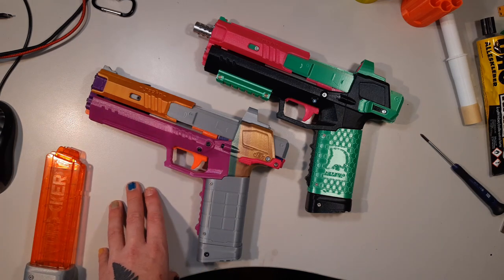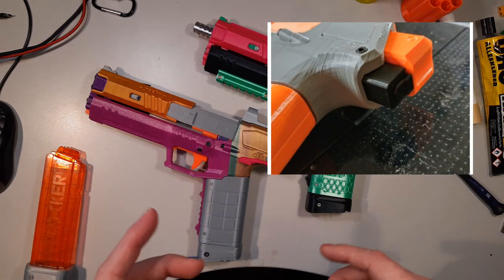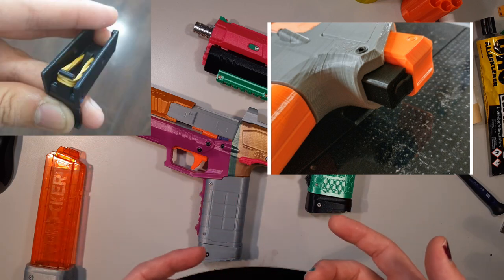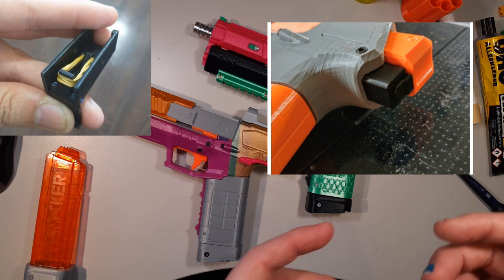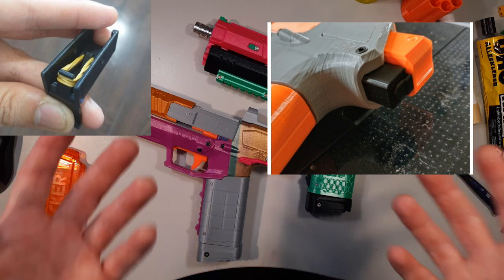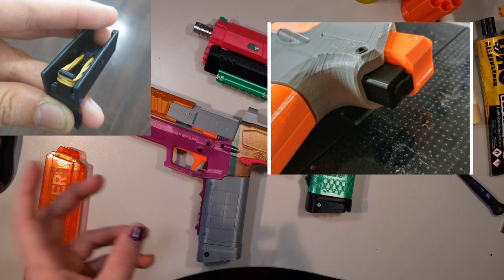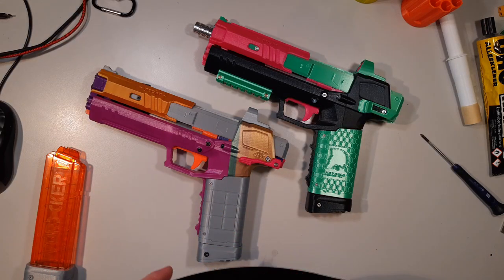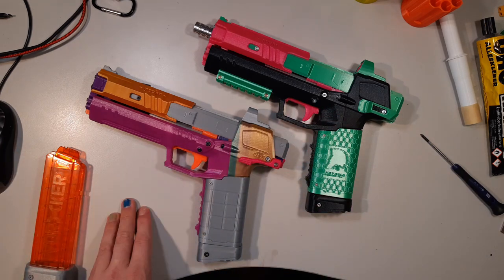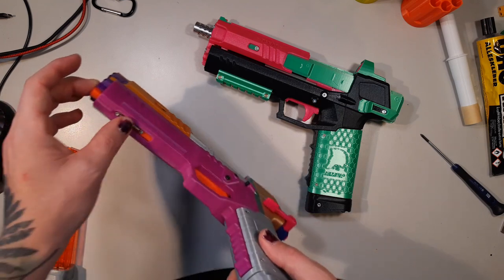Because the Push Button is missing, I want to start with it so you know why. The original design works internally with a rubber band, so it really depends on what kind of rubber band you have available. I'm not the biggest fan of rubber bands because it's very finicky to set up and get right. It has potential to tune to perfection, but it's not like installing a spring that'll always just work. I'm working with the designer on a different spec version that will use a fitted spring similar to the trigger return spring.